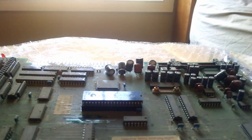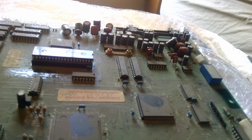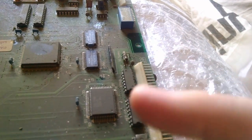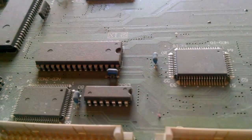It was listed as failed with a video RAM failure. The slow video RAM — if memory serves — should be these two chips here, which are 120 nanosecond. That's the slow video RAM. And over here this is probably the fast video RAM — yes, this is 35 nanosecond, the fast video RAM.